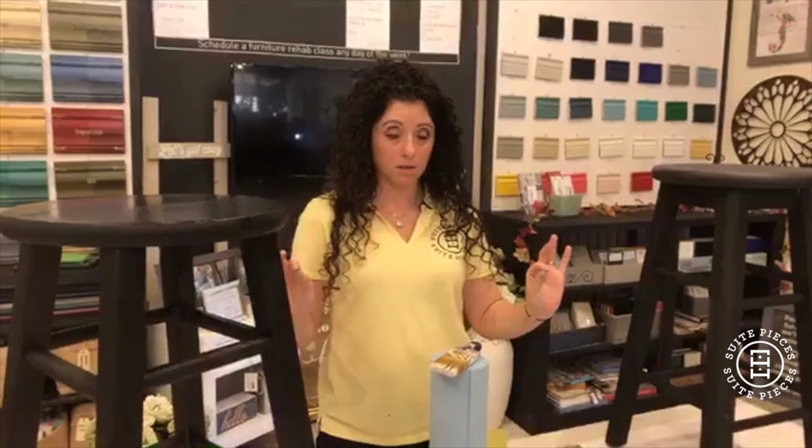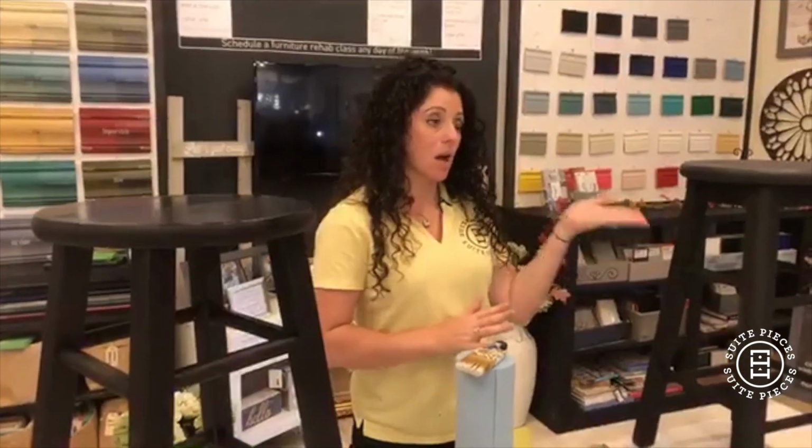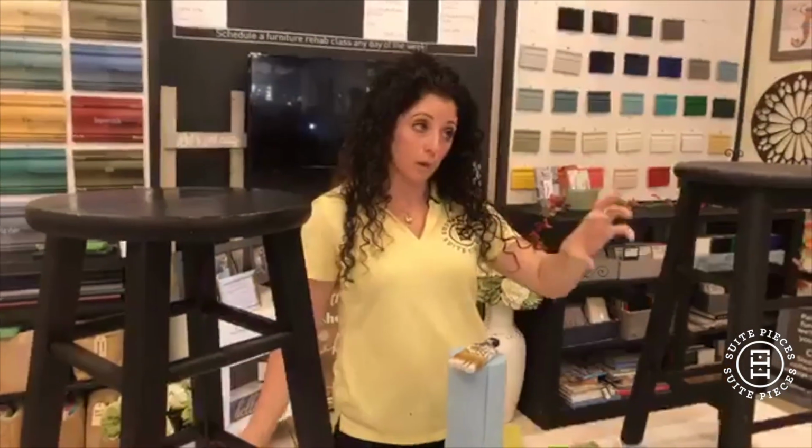If you want to do a white surface, then what we recommend is using the stain blocking white primer, which is, and I can say this confidently, the best on the market. The best. There's not a better one out there, period. It's been tested against every single other stain blocking primer out on the market. It's amazing. It's kind of life changing. So if you need to use a stain blocking primer, that is a primer that you should be using. So you could do that, then put the matte finish on top of it, and then seal it with a top coat if you're doing white.